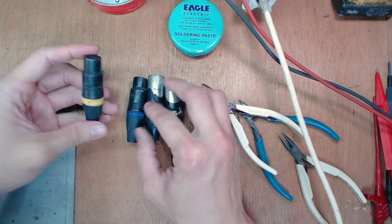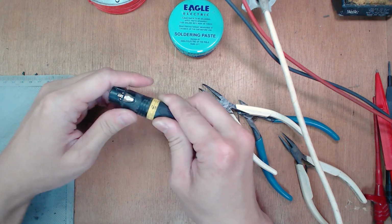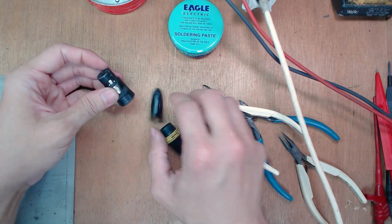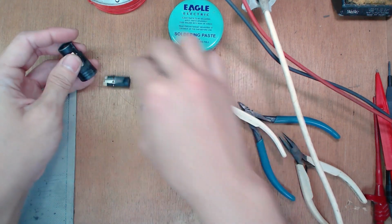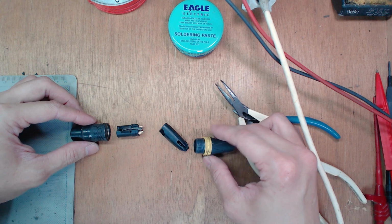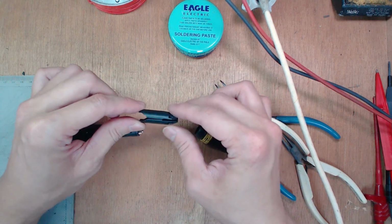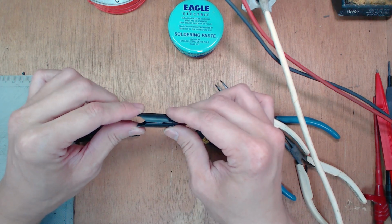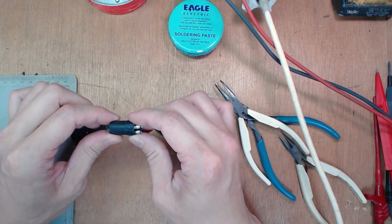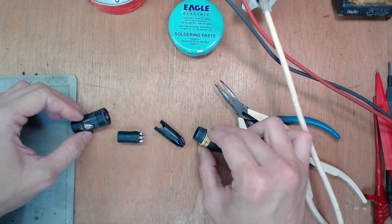All right, let's talk about the cable connectors first. Let's focus on the female plug. Most XLR connectors are pretty standard. They twist open. There you go. And they usually break out into 4 parts. You have the boot, the one at the far end. Then you have the cable clamp, which some people call the chuck. You have the insert, which is the actual internal part of the XLR connector, and then you have the outer casing. Those are the four general parts of your female connector.